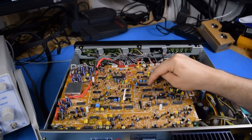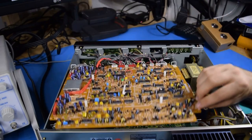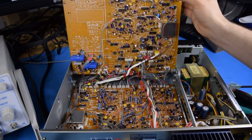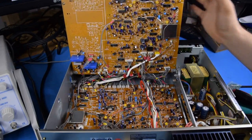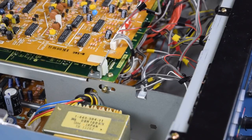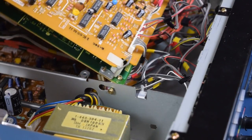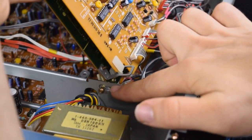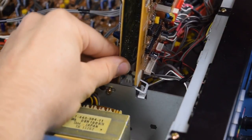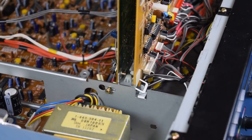After getting a little braver to figure out where the signal goes after it comes out of the bottom of this chip, I've determined that this thing is actually extremely well designed for service. The two boards on top both pivot and allow you access to underneath them — it's really well done. It still doesn't stop this thing from being an absolute monster of design though. It's a good thing this works; I would hate to have to recap it. So many trim pots — that's gotta take forever to properly calibrate. I'm unabashedly a fan of Sony products. Look at this detail: there's a little hook in the middle of nowhere, and when you pull the circuit boards back there's a channel that a screw can slide along. You put that hook back there, pull the screw forward, and it locks the board in place so it can't fall forward while you're working. This is just so well designed.